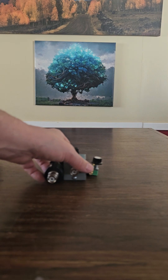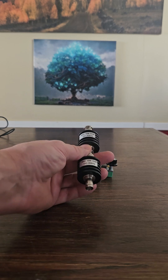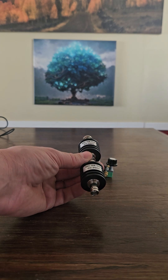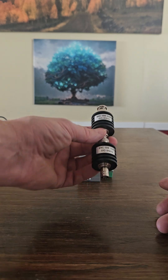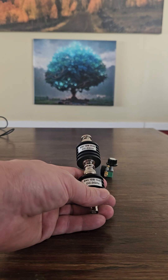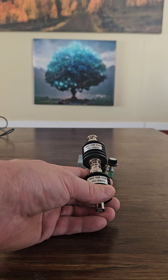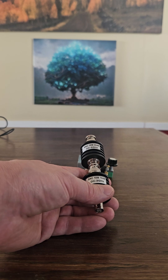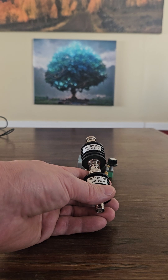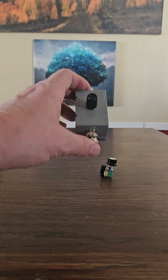The next equipment you might want to invest in is attenuators. These are passive attenuators — this one knocks it down 30 dB, this one knocks it down 10 dB, and you can run them in-line to get 40 dB if you have a super strong signal. What these do is if you've got a signal so strong that your S-meter isn't dropping, you put these in-line between your antenna and your receiver. They drop the signal strength so you can finally see the S-meter dropping, which is how you judge where the signal is coming from.